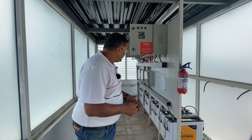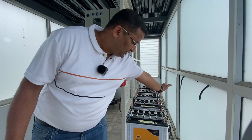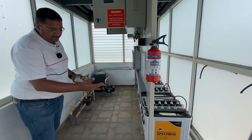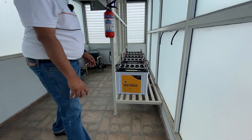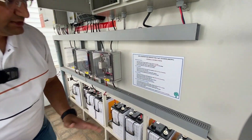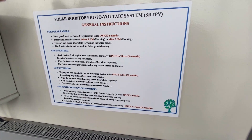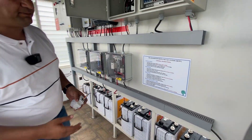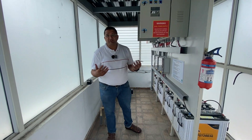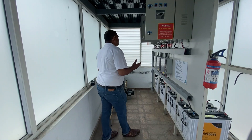Since this is an electrical panel housing so many batteries, it's important to have a fire extinguisher. This is our battery bank — 8 batteries each of 200Ah, 12 volt, making a 48 volt battery system. Slight elevation has been given so that even if there's water logging, the batteries don't get affected. We have also pasted general maintenance instructions on the panel — this is our standard practice at most sites. Instructions cover cleaning panels as often as possible during non-peak sunshine hours, checking terminations, and checking for mechanical integrity, so the customer knows what preventive maintenance is required.